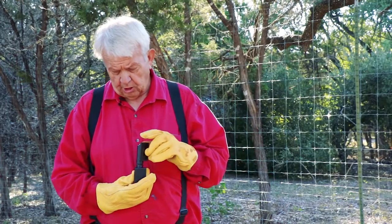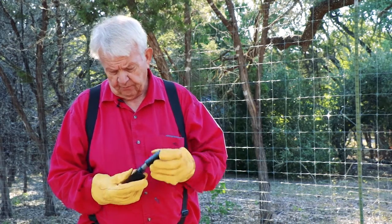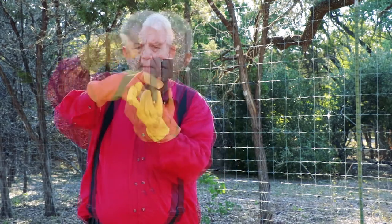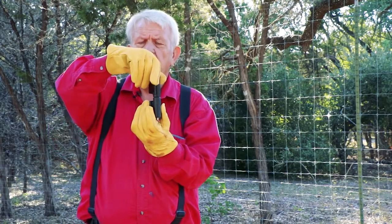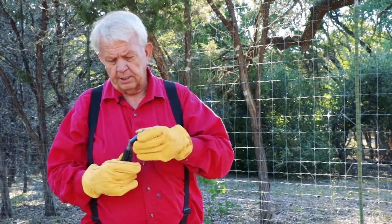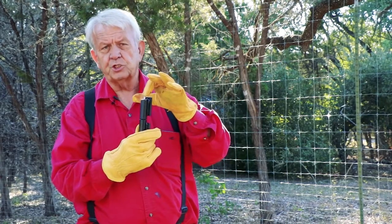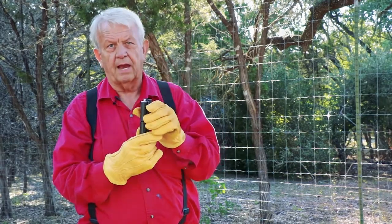When you are installing barrel hinges on a gate system, you want to always stay aware of not putting this hinge on with the zerk fitting down. The cap will fill up with water and eventually rinse out the grease and the hinge will rust. You want to keep the hinge where the barrel is on the top, and if you just keep the zerk fitting on the top, you've got it right every time.